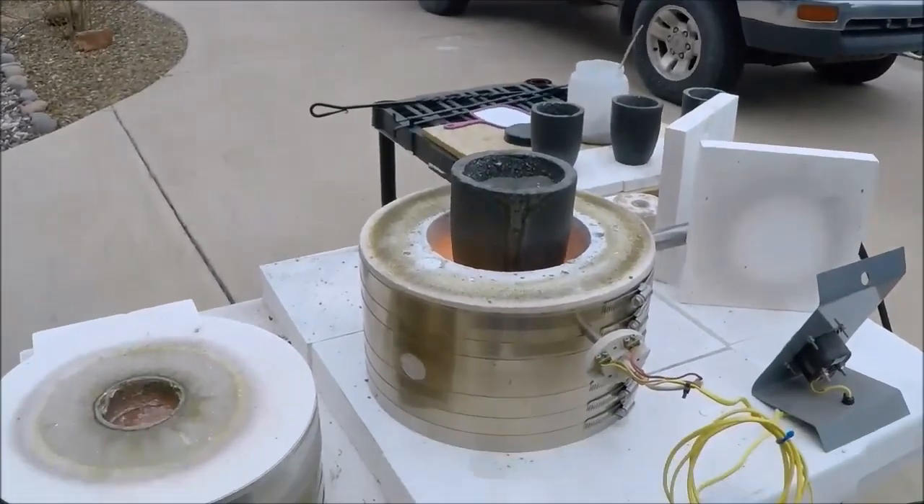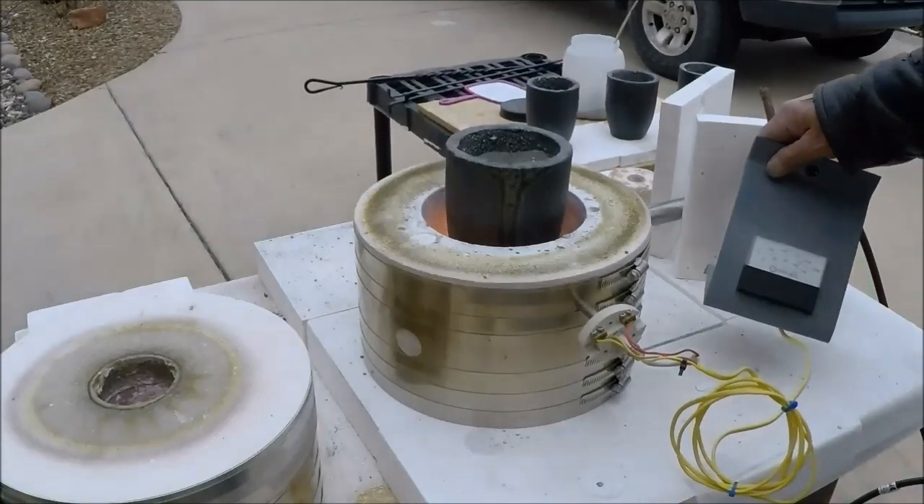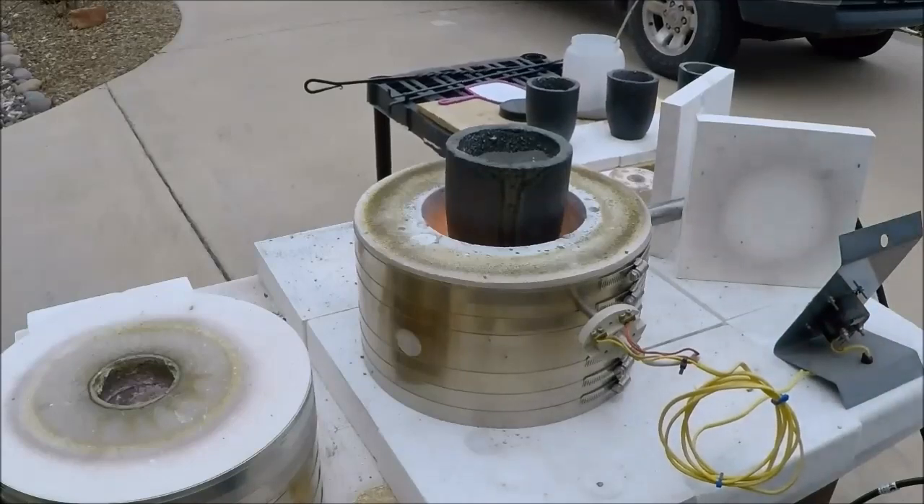Okay, now that crucible is sitting there in the kiln, flame is going around it, sitting on the pedestal, and it's getting warm evenly. Just leave it there for a minute. It was 2,000 degrees in that kiln when I separated it, but as the atmosphere gets into it, it cools down a little bit. So the temperature right now is about 1,700 - just by opening the kiln up we cooled it down. We're allowing the crucible to warm up a little bit without stacking the kiln together, and once we put the kiln together it will continue to heat the crucible more evenly.